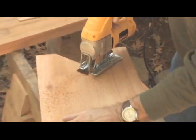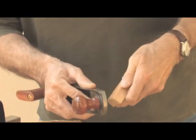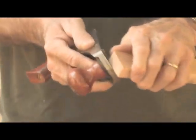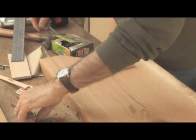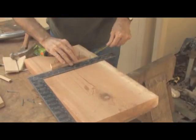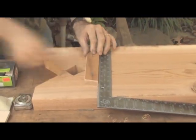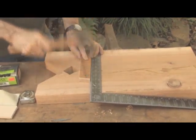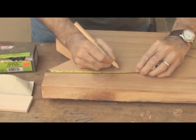Inside cuts will take some time and greater care. Now it's time to assemble the base. I start with a little chamfer on that edge — end grain first. Brush edges on the inside support should be sanded first. Use the carpenter square to align the shelf supports in place on the inside of the sides. You will find it helpful to get the nails partway driven into the stock before carefully placing it in position, then drive the nails through the support and into the sides.